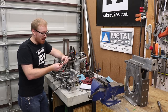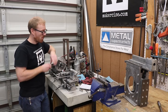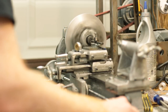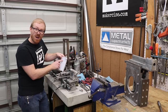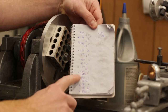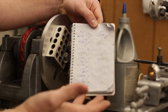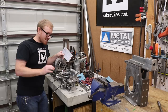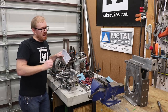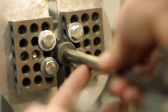This is about 500 and 2 thousandths diameter, and that's what I hit — 500 and 2 thousandths for the bore. Pretty much, I just used my little markings on my carriage of my lathe to move the carriage out by about 5 thousandths per operation. That enlarges the bore by 10 thousandths per operation, and then once I got within 10 or so, I backed it off to 3 thousandths. I'd make a couple of spring passes where I didn't move the cross-feed at all, and that little bit just helps me shave off less than a thousandth. Really happy about how this turned out — I think these tools helped me get there.